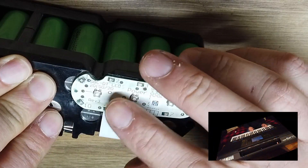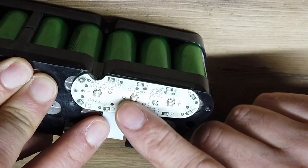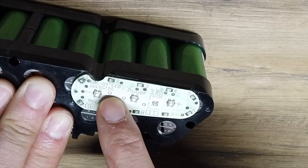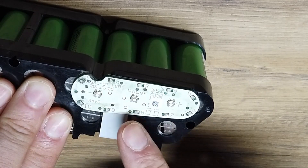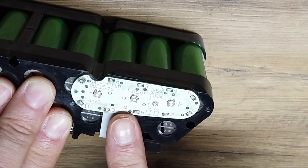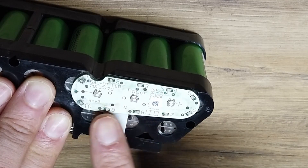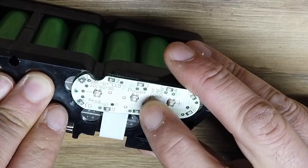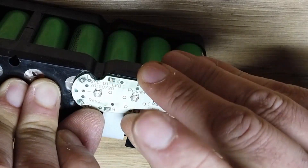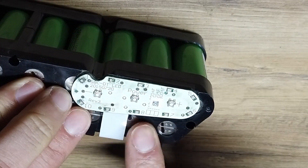It can't be a single layer — it's got to be a dual layer PCB because the ribbon cable is going into the other side of the PCB, which is a little bit scary. Clearly the problem is the water has ingressed into the underside of that PCB where the power switch and various other buttons are — underneath, between the ribbon cable and the PCB. There's a bunch of corrosion in there which is definitely causing some issues. I'd love to get this PCB off, but it appears to be glued in place, and prying risks snapping the PCB or breaking one of the tracks.